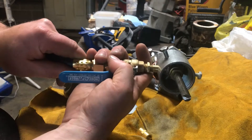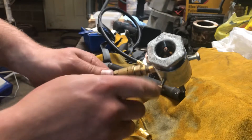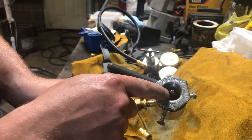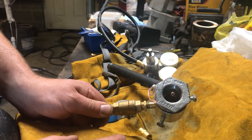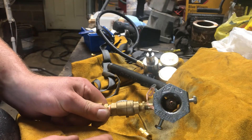It's a nice simple design and doesn't take me very long to put together. I've got a bunch of these with different injection nozzles depending on what I'm burning. I use an 0.025 welding tip for aluminum, 0.035 for brass and copper, and eventually if I'm going to try to do cast iron I might go up to a 0.045.